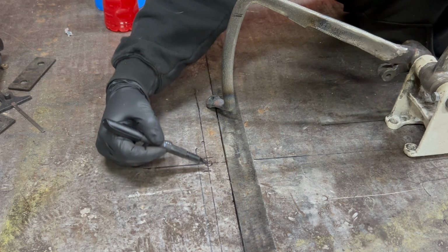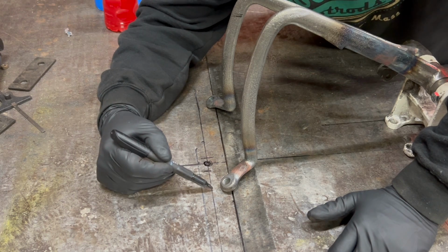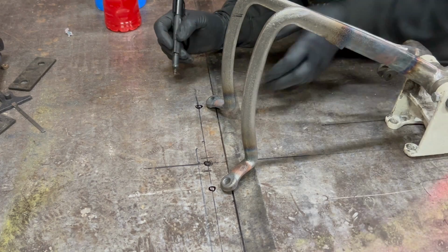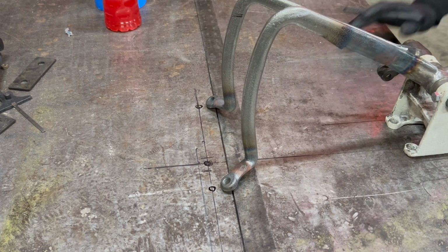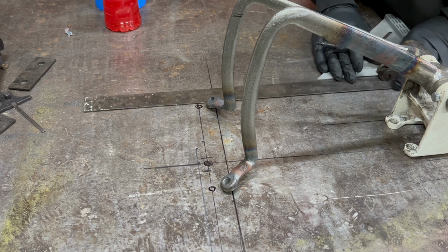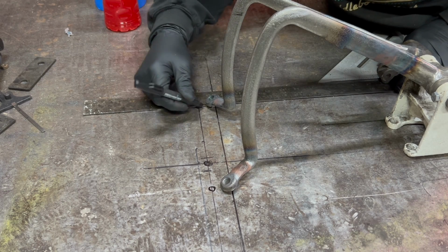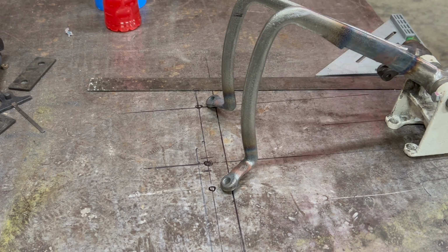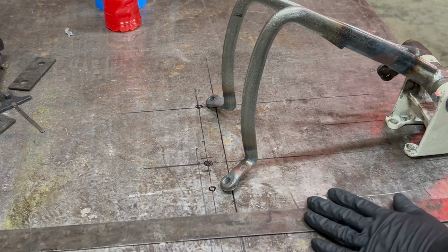So you can see the 1-inch mark before. This is where the pedals were originally. You can see the circle. At this rate, the circle would be right here and the circle would be right here. Essentially, all I'm doing is moving the circle down here. So let me grab a square. At this point here, this measurement is the one I care about right now. When my pedals go back together, especially this one, it's in the exact same line it was in prior.